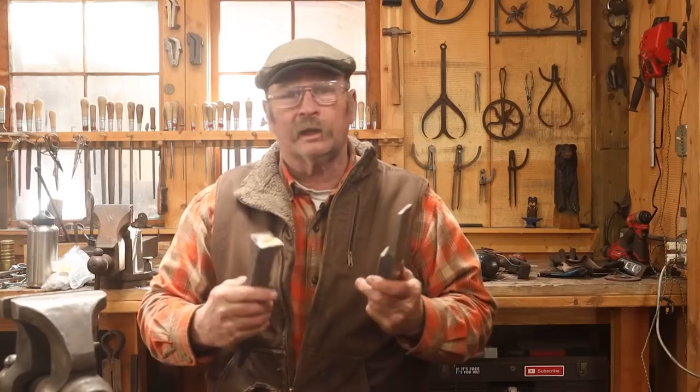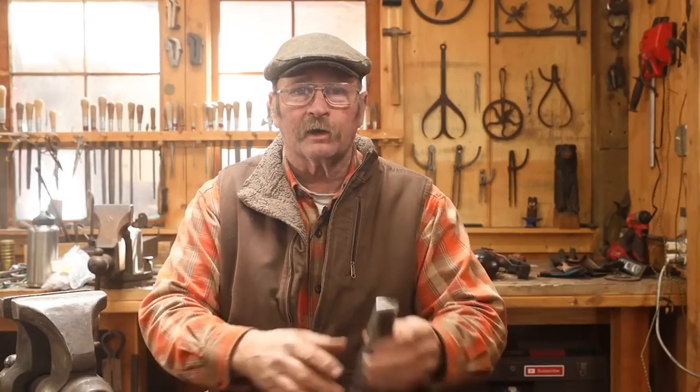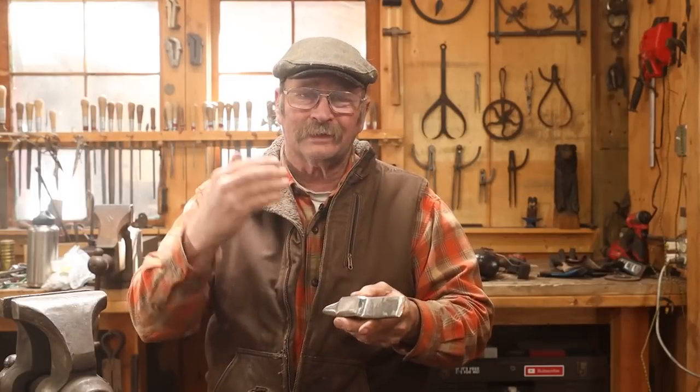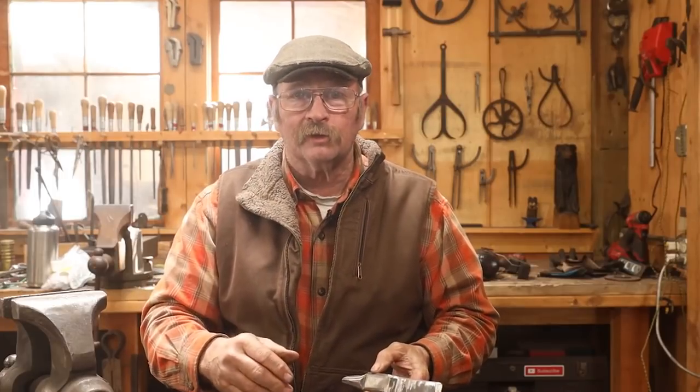Then I'm going to finish welding it up with a stick welder because I think I can get deeper penetration welds with the stick welder than I can with a MIG welder. And I'll just work very methodically. I'll go side to side, top to bottom, front to back, and work around, clean the welds up after every pass, and try to do my absolute best job with this.